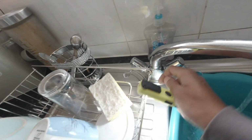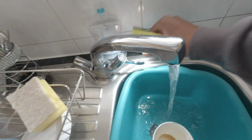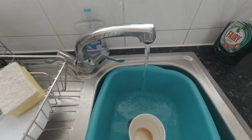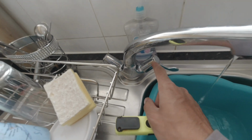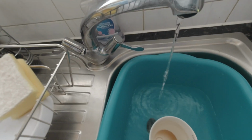So the first thing we've got to do is turn the water off to the property. The stopcock is all the way down there at the bottom, but they've got a lever valve here. We should be able to turn it off. I'll move this fridge, oh it's heavy, out the way. That's it, water's off. Open up hot and cold. Remember guys, it's very important that you leave these open. So when we crack that nut upstairs, water will continuously flow out here.